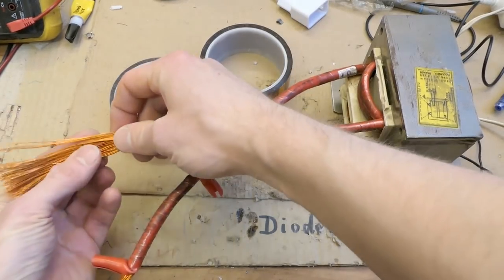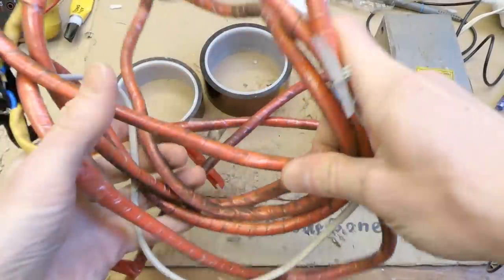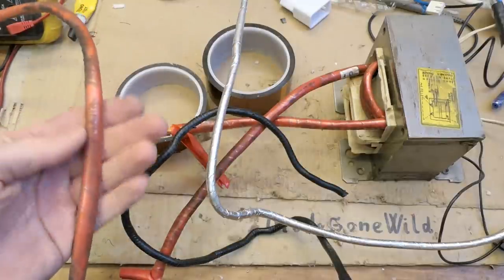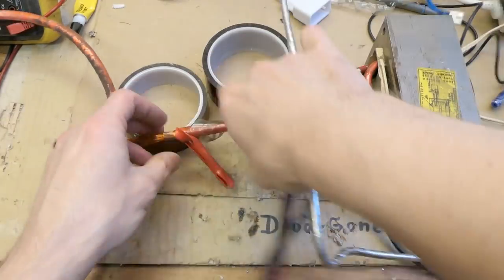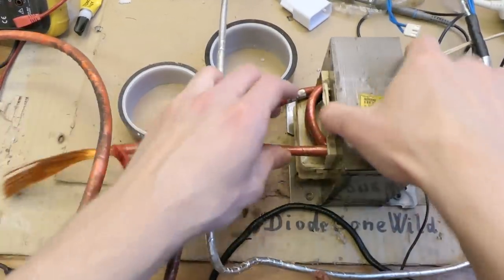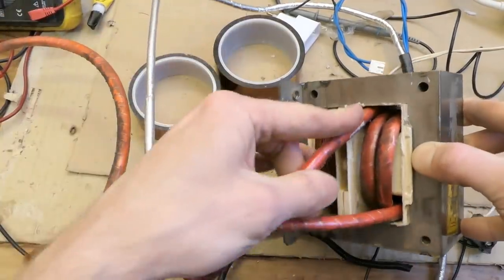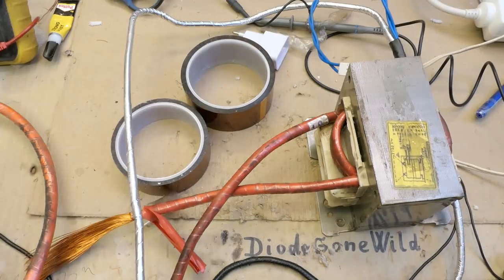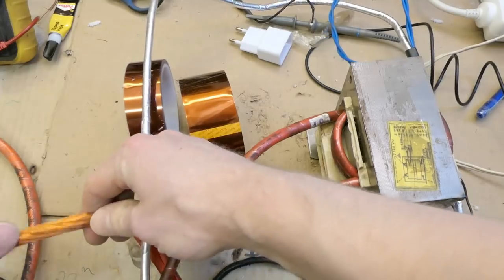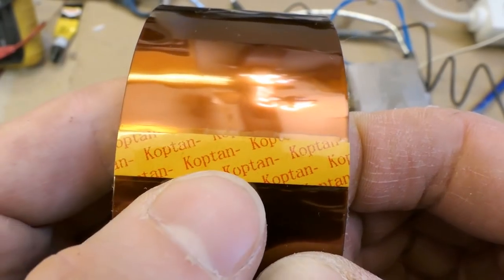The disadvantage is that the wires have lacquer on them, so at the end you have to get rid of the lacquer — a bit annoying. I have a lot of super thick degaussing coils from old CRT televisions so I decided to try those. The red ones from the 80s are much thicker than later ones and have double insulation — transparent and red. The problem is this insulation takes a lot of space in the transformer window. For efficiency you want as much copper as possible, so I could remove the isolation and wrap it in thinner Kapton tape instead.